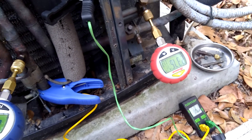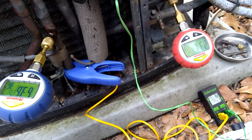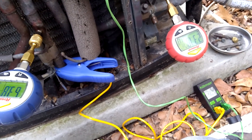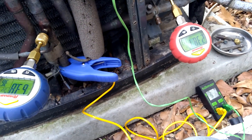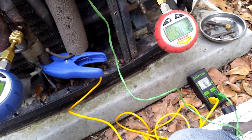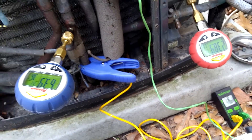Keep in mind that heat pumps in heating mode can have an elevated subcooling. A lot of times the refrigerant needed for both cycles is not quite the same, so even if you don't have a charge compensator — or if you do have a charge compensator or some other way to regulate refrigerant from cycle to cycle — you still might have a little bit of different subcooling, because it'll vary quite a bit. Different machines are matched up with different coils too, so that'll vary as well.